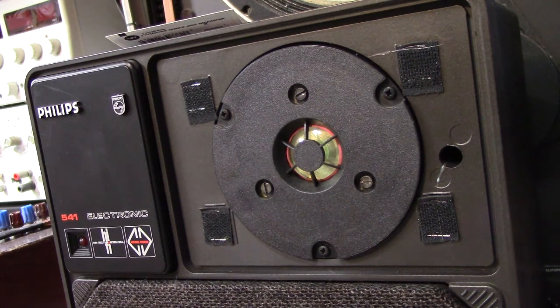The Philips AD0162 is, from all I can gather, a proper replacement for the AD0161. So I don't think I'm going to replace this. I'm of course still going to have to measure the speakers and find out if they sound the same — if they sound different, then there's going to be an issue, but right now I'm suspecting that these two are going to perform just fine. Really weird, because these units are not many serial numbers apart — just a couple of hundred. So these two must be from the time when they switched over to the new style tweeter, or were manufactured at different assembly plants.